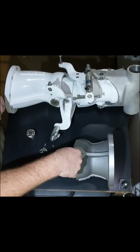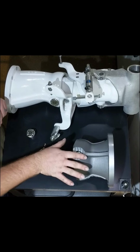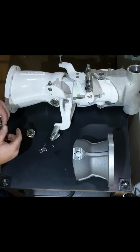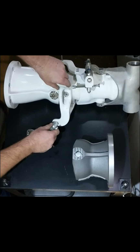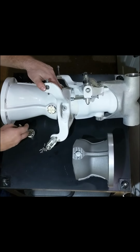We use this bore to establish this surface. So we pick up this bore, set it perpendicular to the mill table, mill this flat. It was only like 2 or 3 thousandths is all it took to clean it up, and then drill the holes. You can, however, do this modification by hand. This droop was done by me, by hand, with a hand drill.